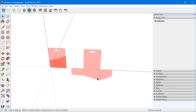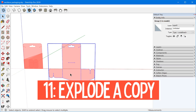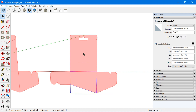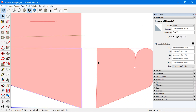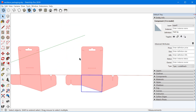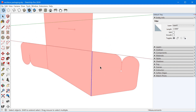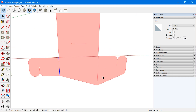Once you've gotten the design to a point where you want to prototype, we need to make a copy of the flattened version and explode it. We don't want to actually explode the original, because if we want to come back and make changes it's nice to have it still intact. So use the move tool, tap Control to make a copy, then right-click and explode. Now we have the individual components. We need to explode again, because we have common edges shared between components — we don't want two tool paths in that location, only one. If we select these and explode them, SketchUp will automatically merge overlapping edges into one entity.